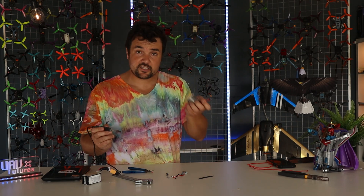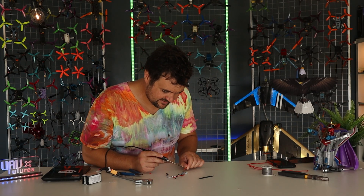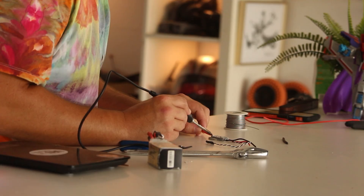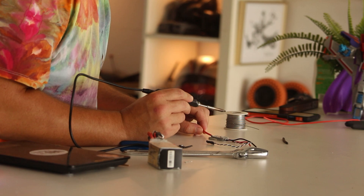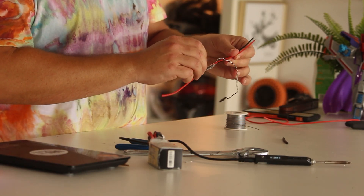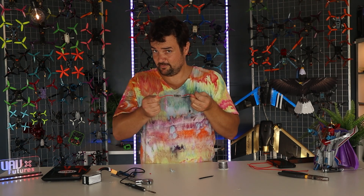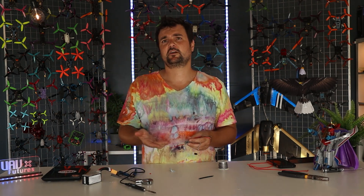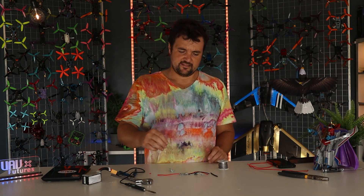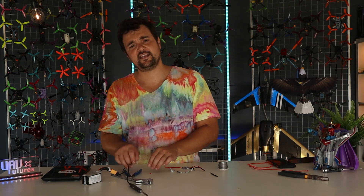Clean soldering iron, simply melt solder onto the wire end to tin it. I like to shake off any excess solder — just don't do this inside, don't flick it on the carpet! Now I have a tinned wire and a tinned pad. Get it into a comfortable position, put the solder to the side — you don't need to keep feeding it in, it's not like welding. Simply rest the iron on the joint with a little bit of solder on the tip to help transfer heat. In and out within about five seconds — and there we go, Bob's your uncle! A very solid pad solder — that's not going to come apart. That is what I call a pad solder: taking a wire and soldering it to a pad on your board, flight controller, or ESC.